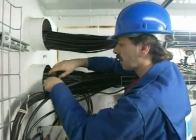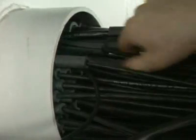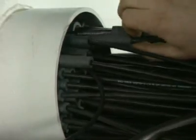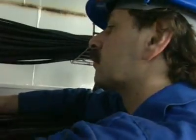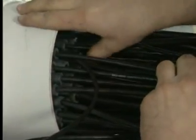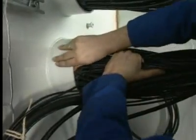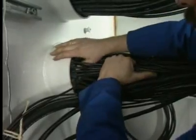In this next example, we have many cables running horizontally into a large diameter conduit pipe. In these large openings, it's advisable, where possible, to place sleeves on the cables as they're pulled through. This makes it easier to fit the sleeves and also prevents overfilling of the conduit. As before, each cable is fitted with the correct size of sleeve.